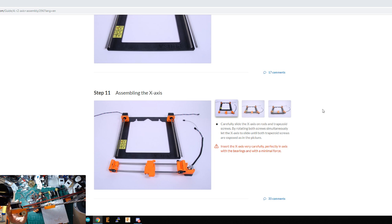So these first. Let's move the rods first, just to make sure that they're even, because they will push the balls out of the linear bearings. They will push the little balls out of the linear bearings if you don't put them in at a perfectly straight angle. Okay, and then we need to catch these screws in. Yep. Cool. I did okay.